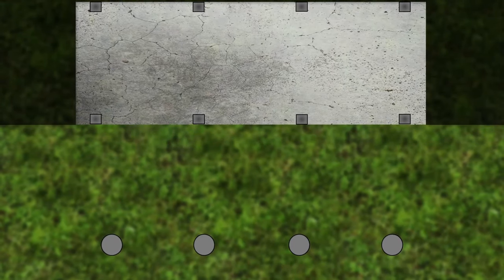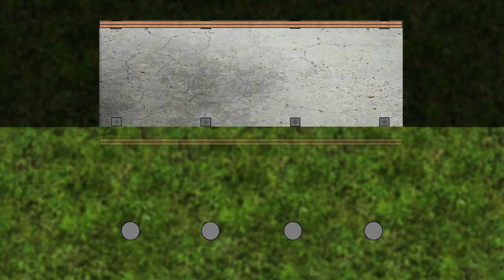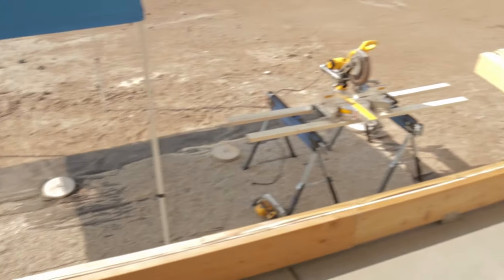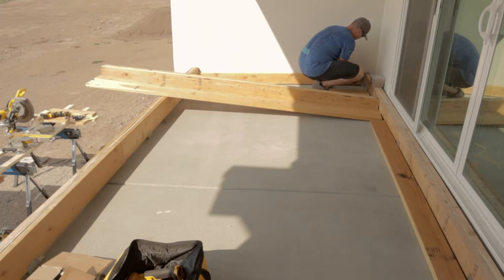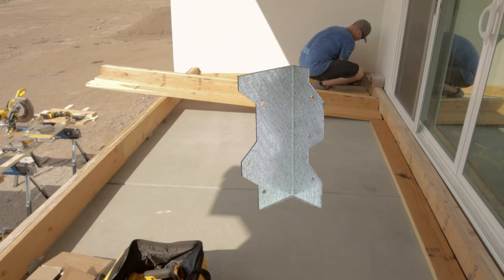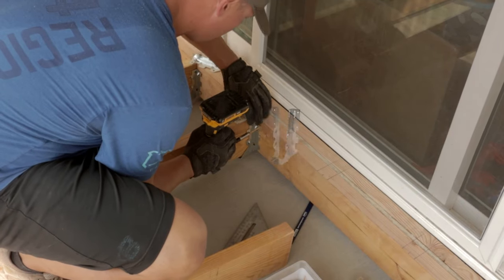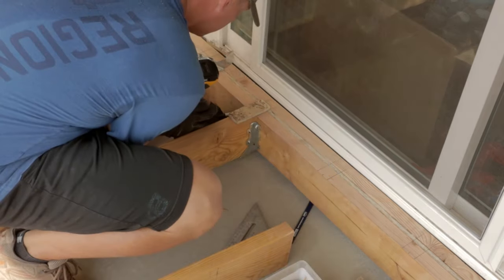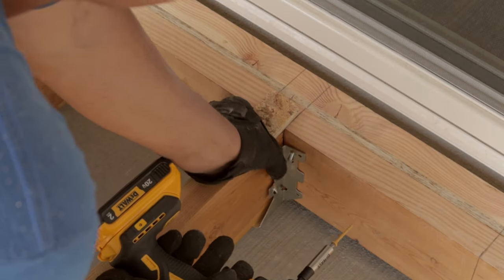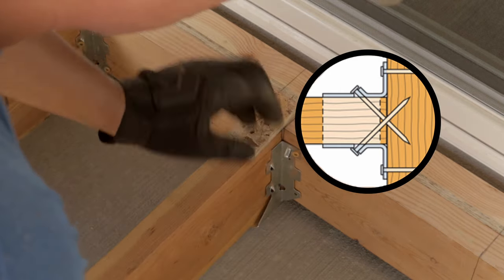Here is a top-view rendition of the deck. On the concrete slab you can see the placement of the brackets as gray squares — those brackets hold the support beam that lays across the concrete slab. Now that our beams are in place we can start placing the joists. The first board is the end joist, connected to the beams using corner framing hardware. The rest of the joists are installed using joist hangers, which adds strength beyond just toenailing — it supports the underside of the joist and the angled nails create an anchoring effect.